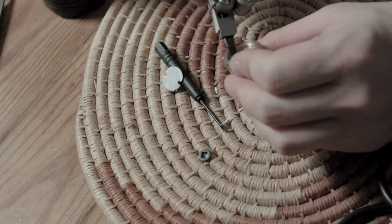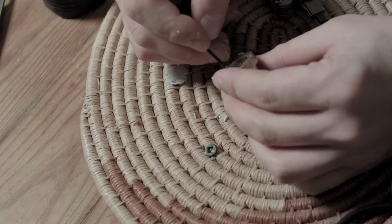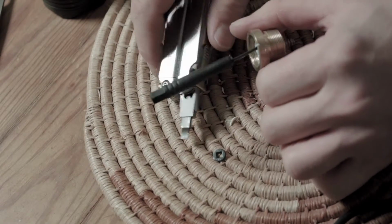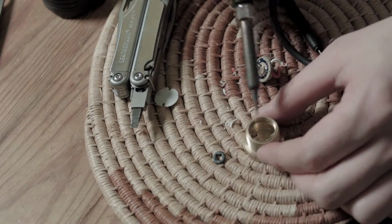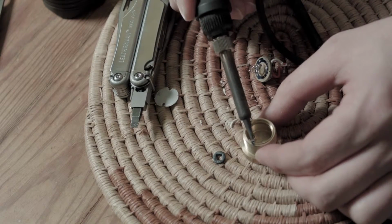Next, I want to pop out the driver. I stick a cute little, compact and manly screwdriver through and hammer it out. This may not be the best method because it will probably damage the driver, and I did, which is okay if you're not using it again or just like making trash for the earth. There was a bit of solder on the underside of it, attaching it to the pill, which is why I kind of screwed it up.